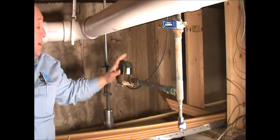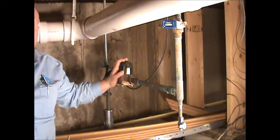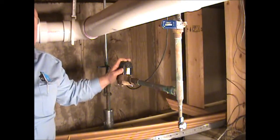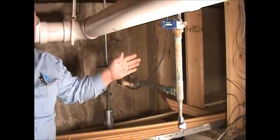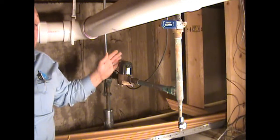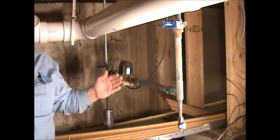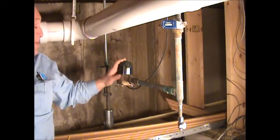Here we are inside the crawl space at the water meter. The water meter can be located in the crawl space, a basement, or just a lower level of the home. If you have a house on a slab, it's going to be on the main floor — typically in a cabinet or a closet. When you're outside looking at the Buffalo box, that'll give you a good indication of what area of the home the water meter is located, since they typically run in a straight line from the B box into the house. The line can be at an angle if the B box had to be moved to avoid a driveway or sidewalk.